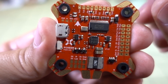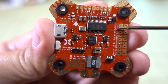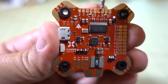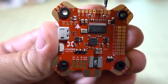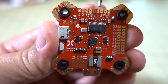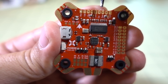You can see pretty much everything — RX3, TX2, RX2, and all your different UART connections. Up here on top you've got RX5, TX5. The most important connections here are for your camera and OSD. You've got your camera connections over here, and then this pad right here is called CC — Camera Control — designed specifically to enable the camera control feature of Betaflight to work with your Foxeer cameras.